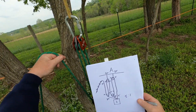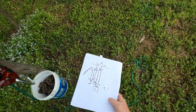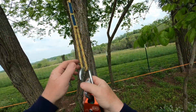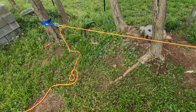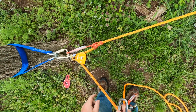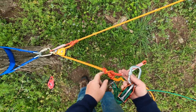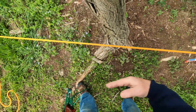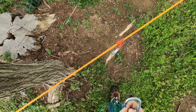Now let's apply this to a sister system. I have a one-to-one set up over here, and we're going to make it into a nine-to-one utilizing this device. On the orange rope I have a load, I've got a progress capture, and I already have a rope grab on here. I'm going to be pulling this tail — bringing the strand with the load on it towards each other — and we're going to accomplish that with a set of fours.